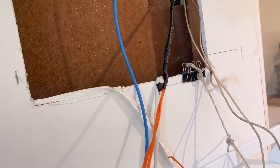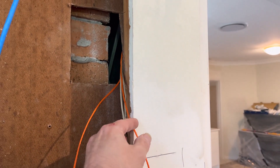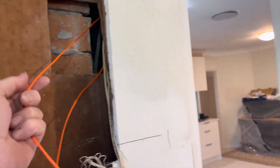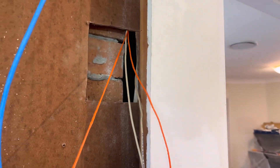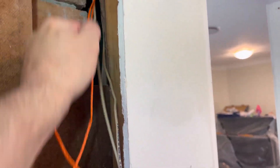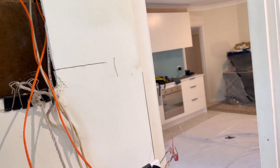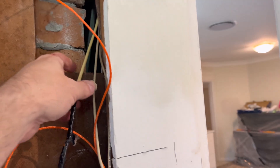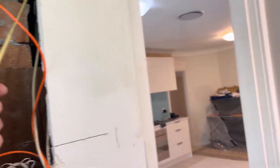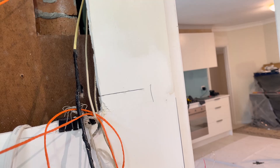If there's a draw wire, just put two draw wires on the other end of it. I'll pull that yellow cable up and then use the other one to pull the cable back. I just jumped up in the ceiling and pulled that cable in and now I should be able to pull this one back. And there's our cable back - now I can just reconnect everything up how it was, and now we can use this one here as a draw wire. Happy days.